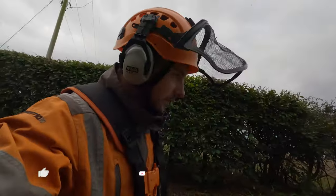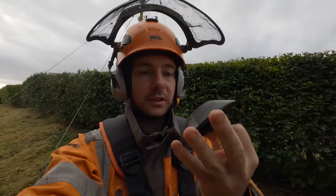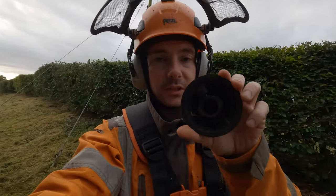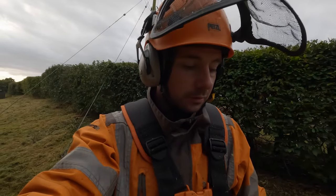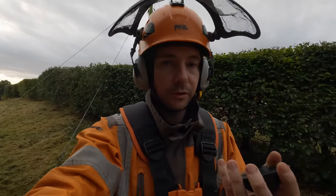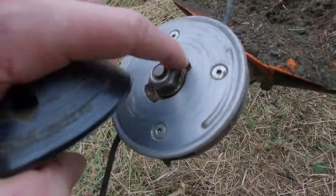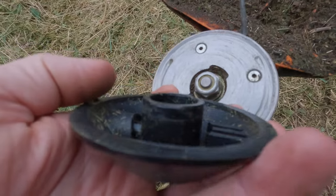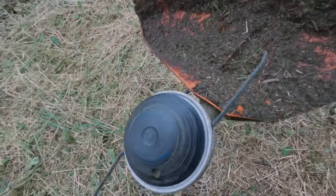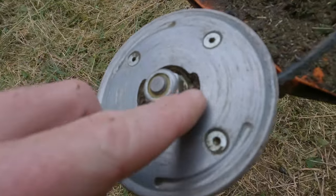One thing that does really annoy me is this plastic piece — I've got it in my pocket because it keeps coming off. It sits on the ground as you're strimming. It just flies off all the time; these little tiny connectors let you push it in and twist it to lock it, but it just comes out. It protects the nut that holds the whole head in, so I don't want to use it without it, but if it keeps coming off there's not much you can do. When it flies off, it just gets full of debris in there and you can't get it back in again.